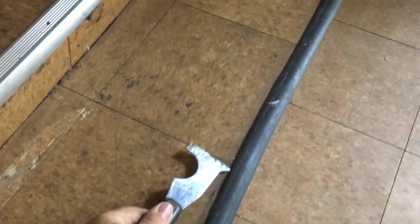You're wondering how to get this edging off. It's simple. Most of it's always glued down. Get your 5-in-1, get behind it, scrape it up and down, back and forth. You could use a hammer. When you're finished, you pull it off like this. Okay? You go easy.